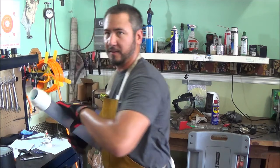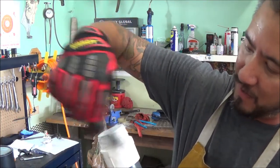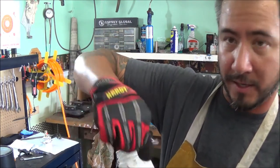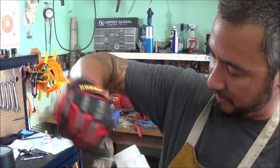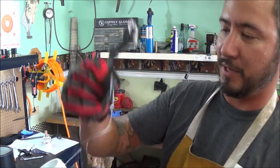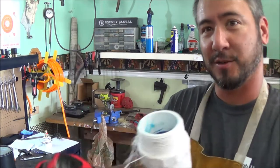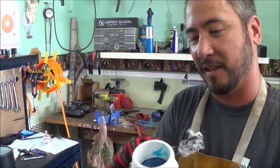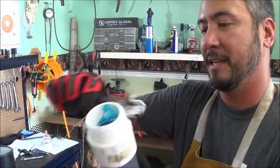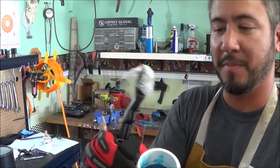And I'll do that on this one too, just because you want to get that Teflon tape off of there before putting on the new, obviously. Make sure you get a good airtight seal and there's no leaks. And once you get some threads pulled out there, sometimes you can just pull it off, but we'll just scrape that all off. We'll get some new Teflon tape on there. We'll pour some new desiccant in and button her up, and we'll be ready to go.